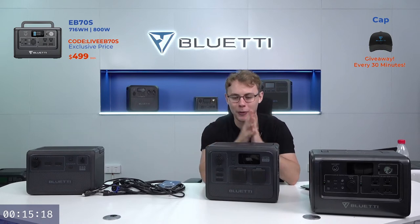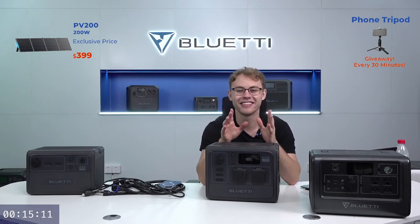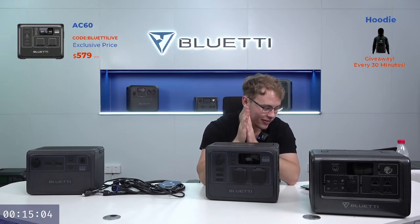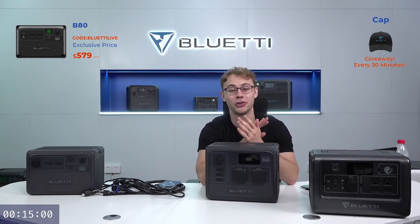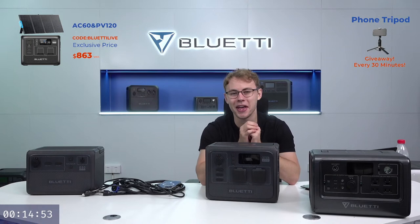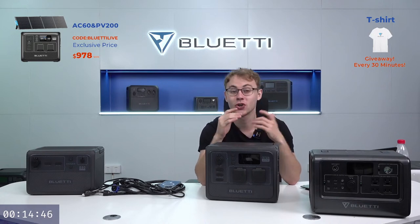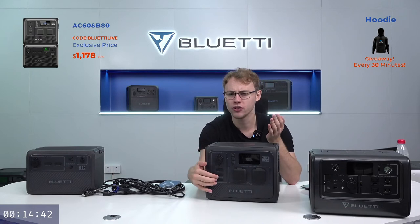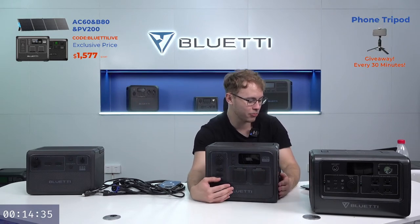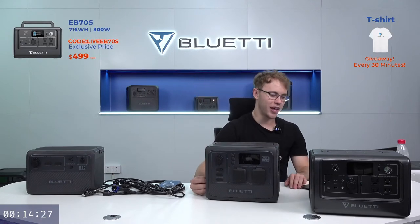Now, the new feature about AC60 is that it's water resistant, right? It's incorrect to say waterproof, so we'll say water resistant. It has IP65, so it's dust resistant and water resistant. It cannot be submerged underwater, just in case you were wondering, but it can handle rain. So if you left it in the rain, don't worry, it will handle the rain, but make sure that all the outputs and inputs are closed, like this, right? With those covers right here, don't remove them, please. They will help AC60 withstand water. Okay, so this is a new feature.